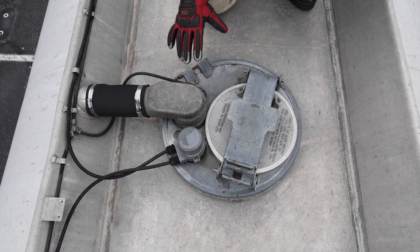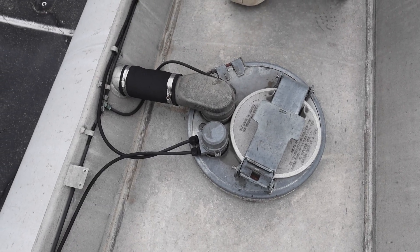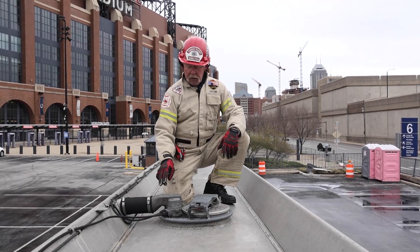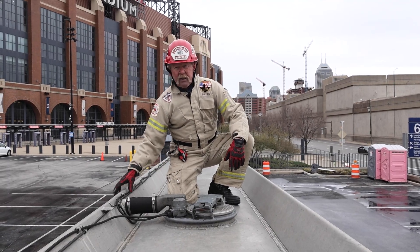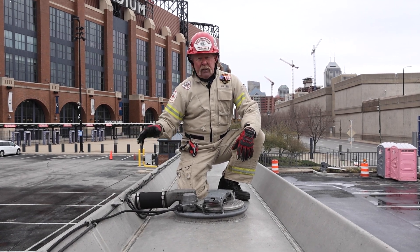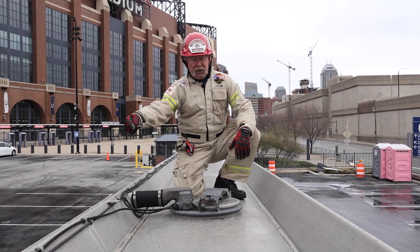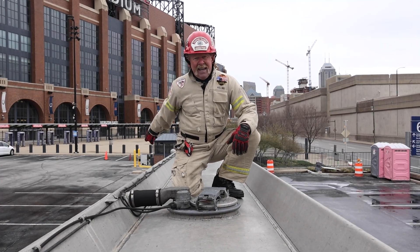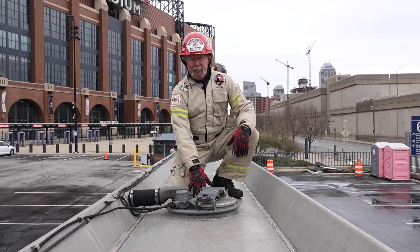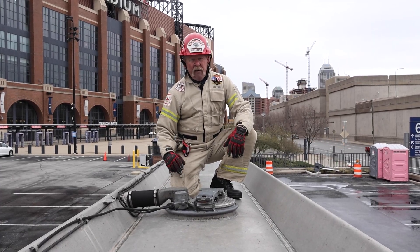The other component here is the vapor valve. This is operated by pneumatic pressure. Whenever the side compartment where the valves are is opened, it automatically opens all these vapor valves, which are connected to this rail. This rail is hollow and is part of the vapor recovery system. When gasoline or diesel is offloaded to a below-ground tank, the vapors are pushed out, go into the vapor hose, which is connected to the vapor lines, comes up the pipe in the back, and connects to this rail so the vapors go back in. As product is being released out the bottom by gravity, the vapors are replacing that cubic footage of space within the tank.